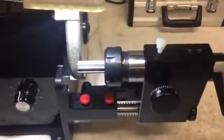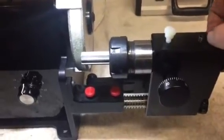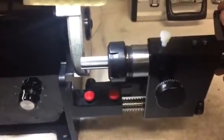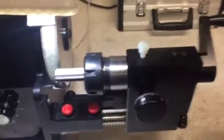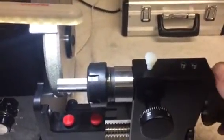That's good for 3 and 6 flutes. If you have an 8-flute or a 2-flute, you can tighten this one here. That will give you your 2, 4, and 8 flutes and you'll index pretty accurately. You just go to one position and it takes you right to the next position.